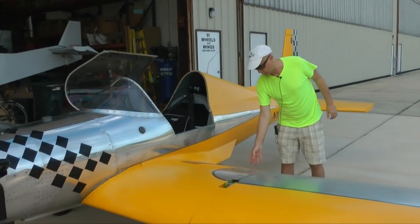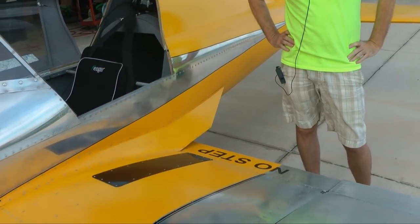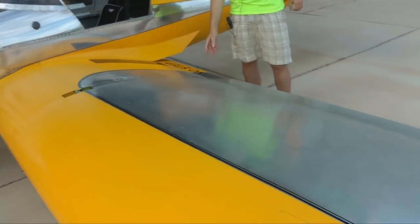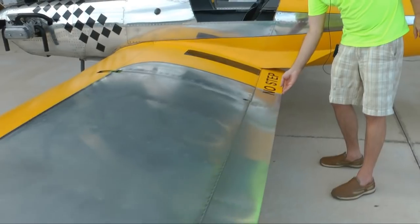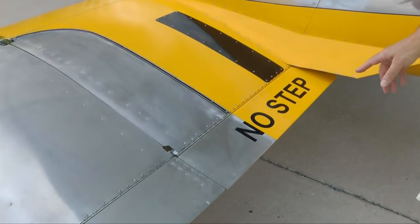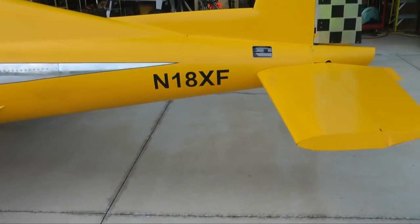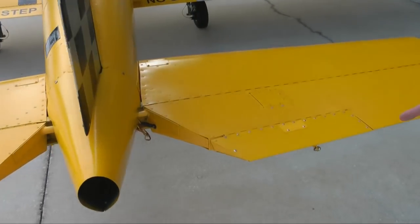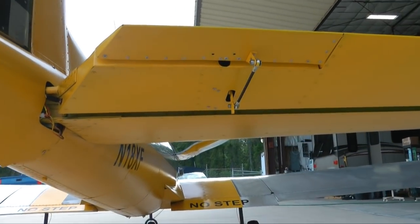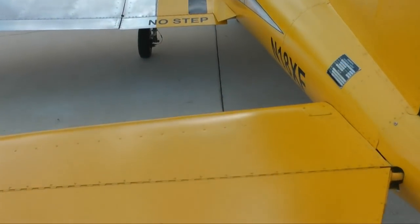The actuation is very straightforward. It's intended to be used with trim tabs, which means the pilot always has full control of the aircraft. That's also what differentiates it from larger autopilots that control flight surfaces directly. Here I've implemented it on secondary control surfaces — these are usually flaps on the H-5, but I've converted them to secondary ailerons, so they go up and down to automatically control roll. On the back for pitch, I've gone with just the trim tab. Underneath, it's really just a large radio-controlled plane linkage, and the servos are very small, lightweight, and typically less than $100.